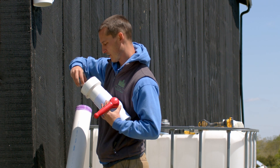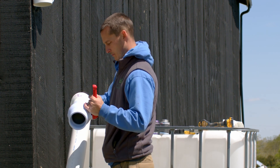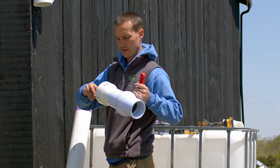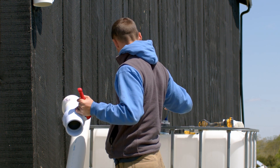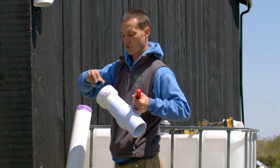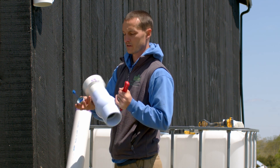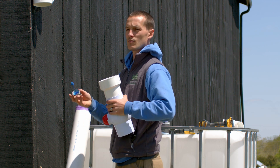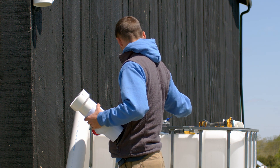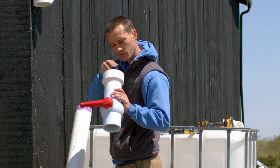I got a little bit fancy here — you don't really have to — but these large diameter ball valves are pretty expensive. However, it's really handy to use a ball valve rather than a screw-in plug on the end of your first flush diverter pipe. When your first flush diverter fills up, it doesn't do you any good if it's full of water the next time you have a rain event. So there's a little maintenance in this system: you have to drain the first flush diverter between large rain events so it can serve its purpose and has volume to capture that first flush.